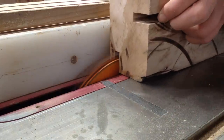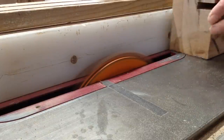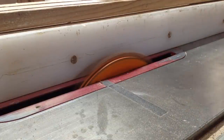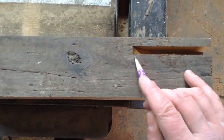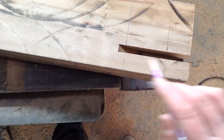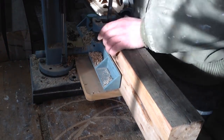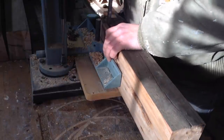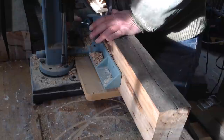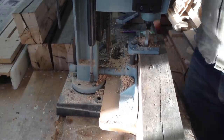The nice thing about benches is that, while I don't intentionally make things unsquare, working with lumber that's not jointed or planed is a challenge. If you're making a bench as square as you can, it's not like a table where it really depends on being square — if these are a little off it's not going to affect the piece at the end of the day. My dado stack cut a little bit further down than planned, but because it's rustic and I'm putting tenon pieces in there you don't even notice it in the finished piece. I was going for three inches: the front part of the piece stays as the haunch and then I just go further down with my mortising bit — on a three-inch tenon, the first inch stays at one-inch depth and the other two-thirds go down deeper, about two and a half inches total.